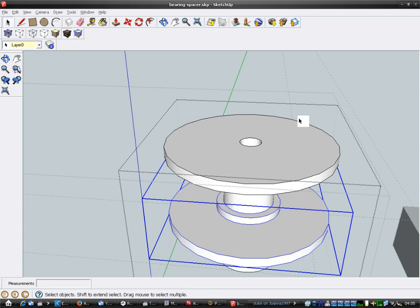Where's the bearing gone? Always go on the bearing, that's the problem. It was only a test print, this, anyway. It was really just a test. I know I can't really put the other metal pulley back on now because I'm using the 6mm wide belt, and the other pulley is just too narrow. It's 3.5mm. It won't fit the 6mm belt, so I'm kind of stuck until these pulleys arrive.